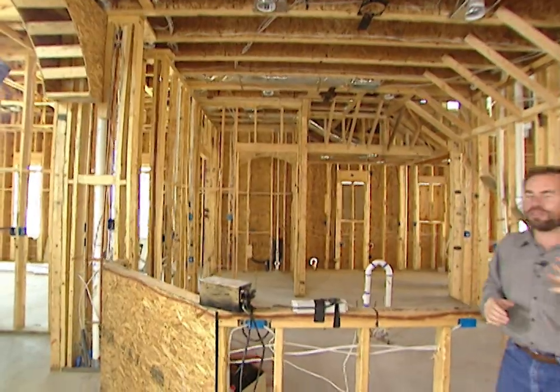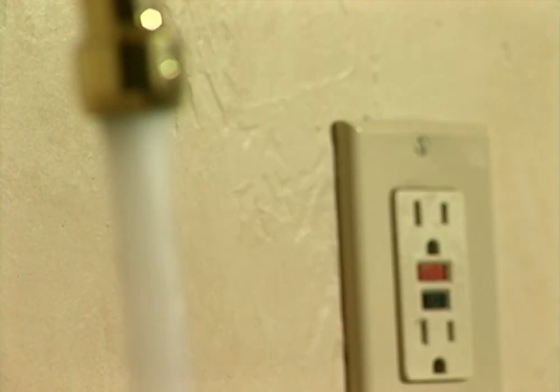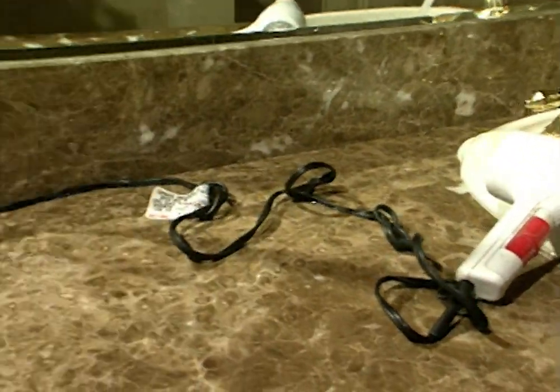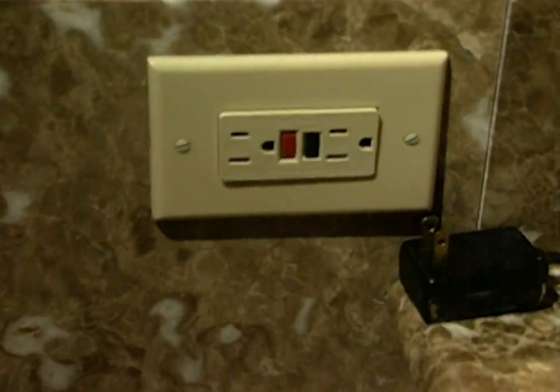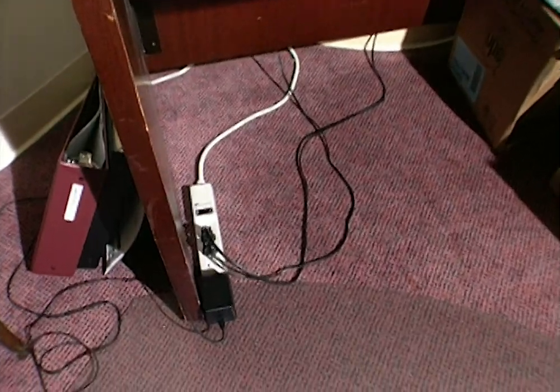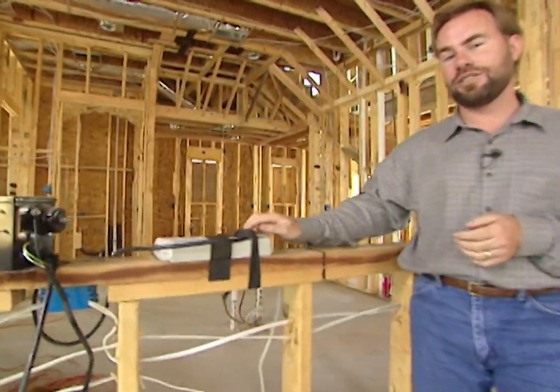Remember to concentrate on those three areas when you're thinking about electricity. First, your ground fault circuit interrupters — those are required by code and you need them in every wet area: kitchens, bathrooms, and don't forget the garage. Plus a surge suppressor — if you ever get hit by lightning or get surges from the power company or equipment inside your house, you need to protect your computers, television sets, and stereo systems. And don't forget your arc fault circuit interrupter to protect you and your loved ones from any electrical accidents.